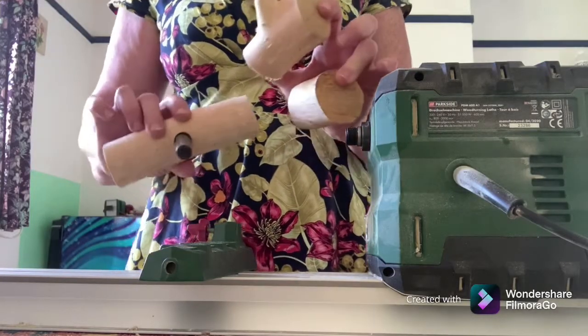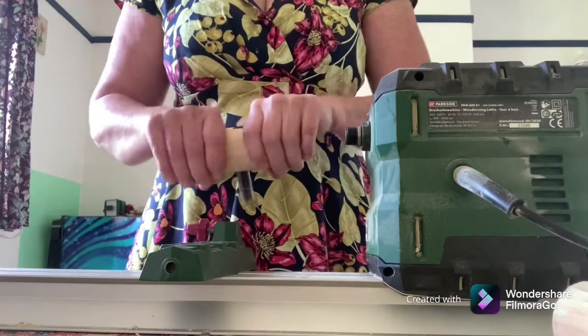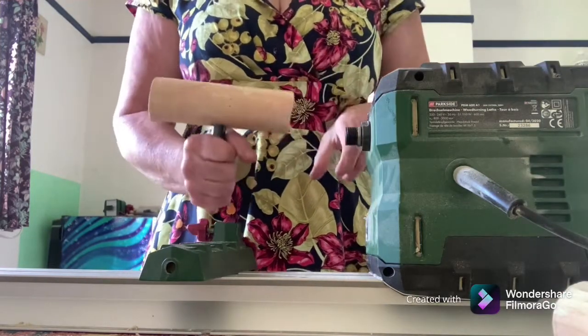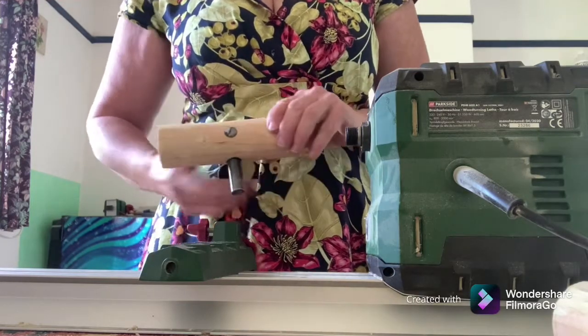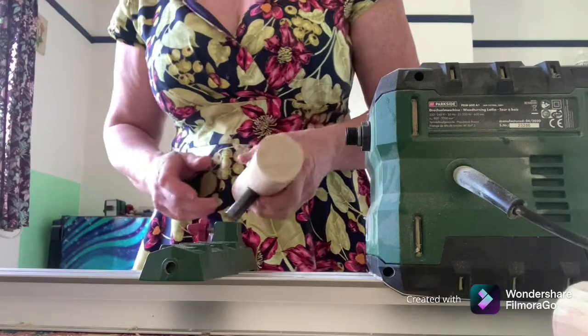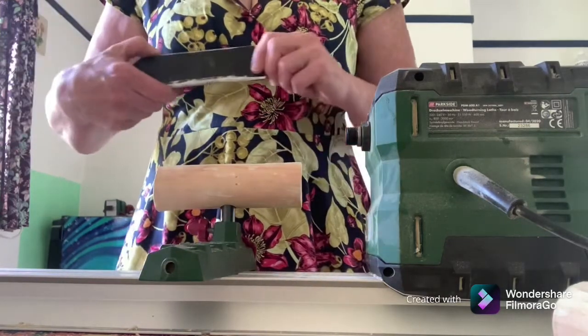I've got two bits of wood left on my four bowl project — a short fat chunky piece and a slightly larger, thinner piece. I'm going to go with the larger piece, and to give this new tool rest half a chance I'm actually going to cut the corners off my log with a hand saw first, just to give me less material to hack away — therefore less work on the tool rest while we see if it works. I'm going to start slow just to make sure it's turning okay.